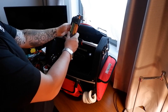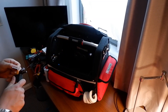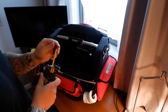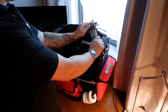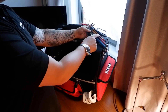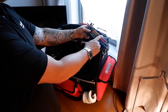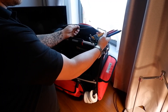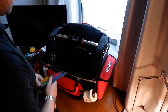Next up is a set of Wiha allen keys, the colored ones with the sleeving on. The problem I found was the allen keys had sleeving all the way down to the ends, so if you've got blind holes where you need to get deep into them, these are no good. On the sizes I usually use - 5, 4, 3, 2, and occasionally 1.5 - I've had to chop all the sleeving back on them. The 5mm one has the sleeving stuck inside the holder, so I think I'm due a new set soon.